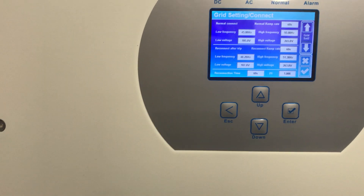With 15 amps set, it'll start charging a bit better. Now the other thing you need to do to charge the battery is make sure you've got a system work mode set, and you need to have your charge option ticked and your time-of-use configured. Right now it's just after seven in the morning, so we're in this time block.